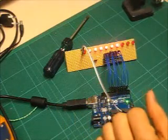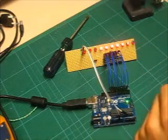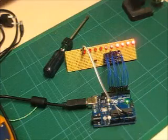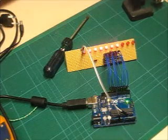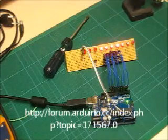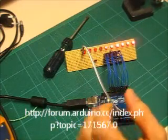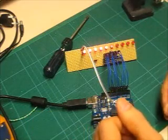Anyway, runaway pancake had a different approach instead of using charlieplexing and PWM. For this 10-LED Cylon scanner, you don't need 10 hardware PWM pins — you can do software PWM — but he went down to the assembler level and used port manipulation, which makes this effect work beautifully. I'll link to the forum post where you can get this code, along with lots of other patterns he put up. It works perfectly on the Arduino IDE 1.0.